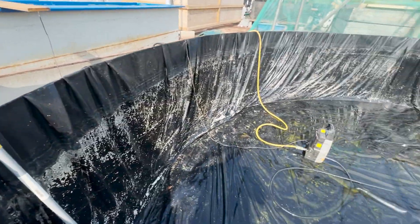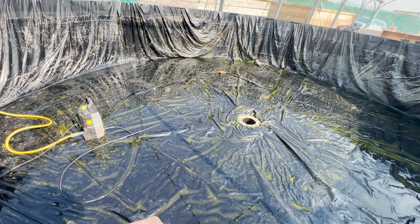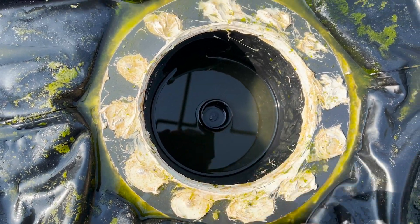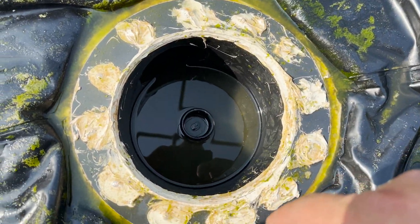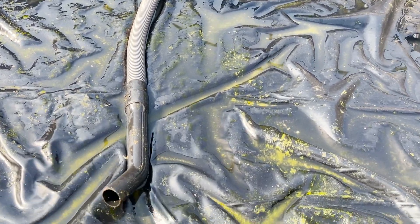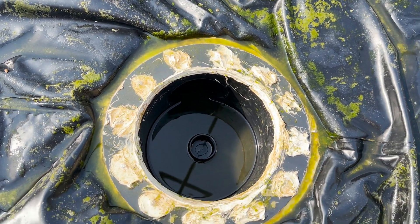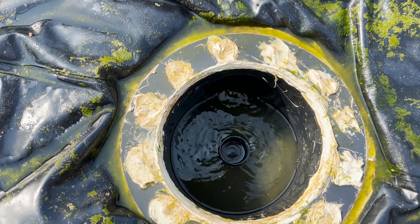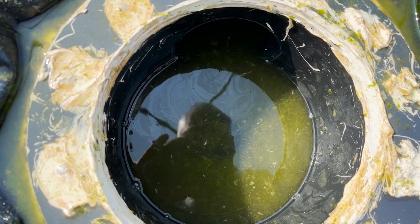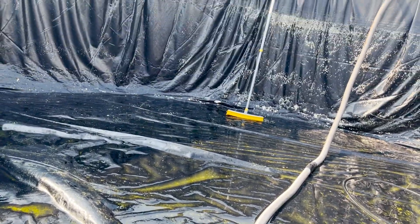So we can actually go ahead and purge it off properly. Let me take the hose off there, finish my cup of coffee, and I'll show you the bottom drain for how much gunk actually comes out. John's just going around there now to feed the hose through. As you can see, the bottom is looking relatively clear at the moment - we've still got to move it off around the edges. We're going to let this bite dry before we go ahead and fill it, and then we'll fill it with chloramine-T just to eradicate any problems.